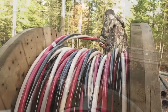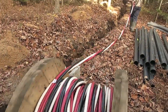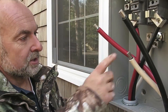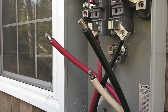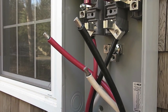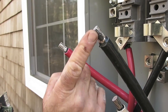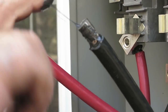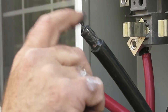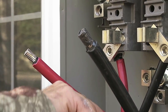This is aluminum wire — most service cables are aluminum wire these days and it has the potential to oxidize. So you've got to put on this conductive grease: it conducts electricity but it also prevents oxidization of the electrical connection. Because if it oxidized, you get resistance and heat, and at best you'd have a failure and at worst it could heat up enough to cause a fire.